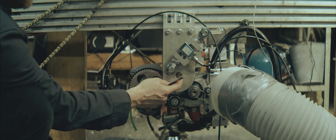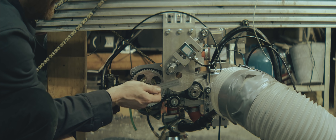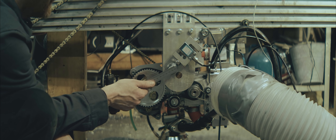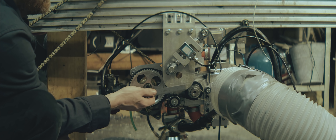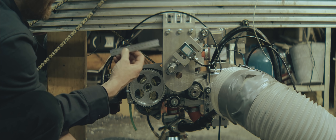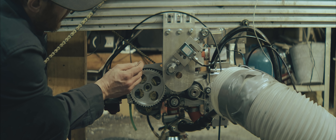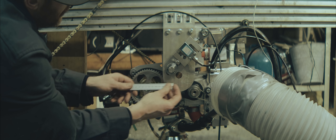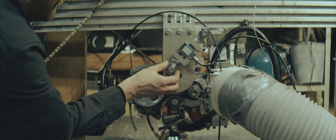The other calibration I did was half a meter from here with five kilograms. I did some calculations and I think if I did it right, that's 83 kilograms here, which is almost twice the rating of this load cell. The recommendation is to calibrate with half the weight rating - 25 kilograms - which means five kilograms at 15 centimeters from the center correlates pretty well with that bolt. I'm going to hang the five kilogram weight from that bolt, do the proper measurement, and check the exact distance. Could help with the erratic behavior.